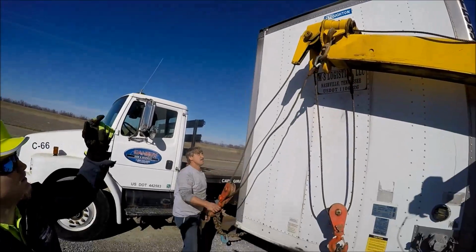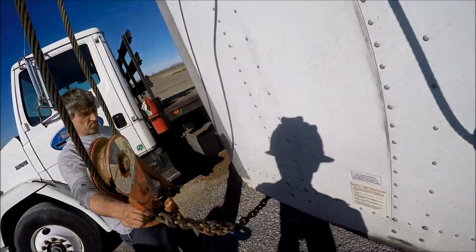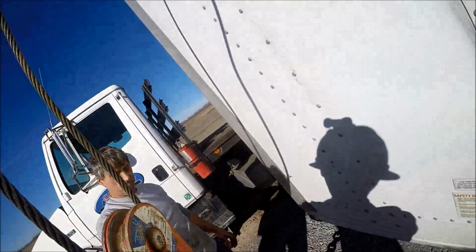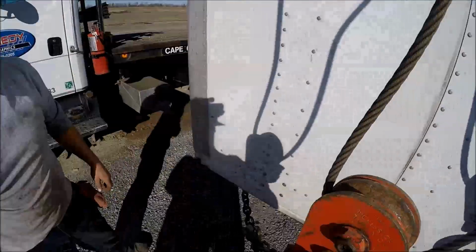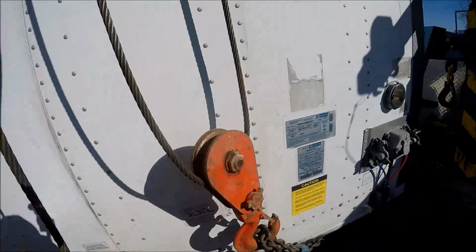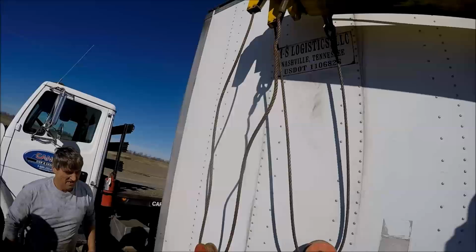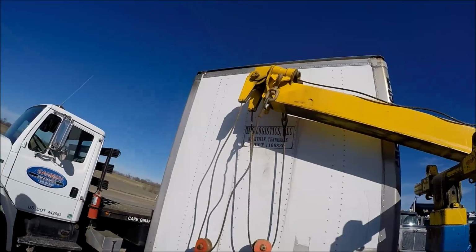Now, you want to be up higher. Now, Raymond, I know you've not worked with us for long. You always want your point tip away from the material that you're lifting, and you don't want your chain twisted. All right, your cables are locked.